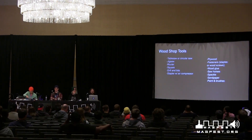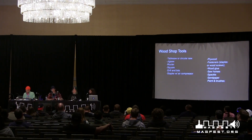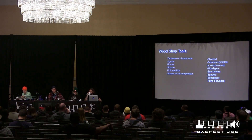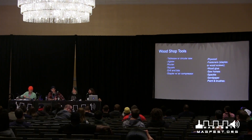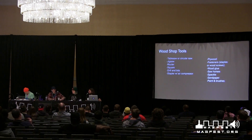We're going to talk a little about the tools you can use to build an arcade cabinet in a generic sense. It's actually pretty easy — it depends on what you have access to already. If you don't have access to some of these things, your options are making the investment in some tools, or if you live near a city you probably have a local maker space that has these things and more. I would recommend a table saw — it's the superior saw — but if you only have a circular saw, you can make it work. A jigsaw or bandsaw is useful for some fine detail cutting. You need a router, mostly for any fun shapes you make or cutouts like our screen cutout, buttonholes, or any inset.